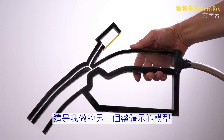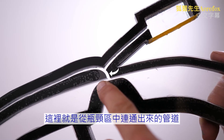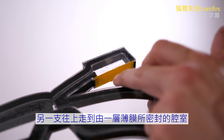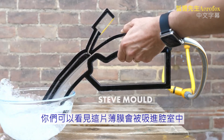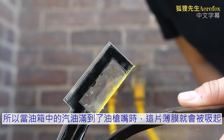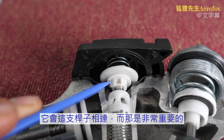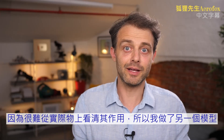Here's my attempt to put that all together. You have the main tube with a constriction, and a tube coming off the constriction that forks — one side goes to the end of the nozzle, the other goes to a chamber sealed by a membrane. When the liquid in the tank reaches the end of the Venturi tube, you see the membrane gets sucked into the chamber. So when petrol reaches the end of the nozzle, this membrane moves — and it's attached to a rod, which is really important because that's how the nozzle actually turns off.